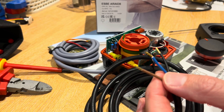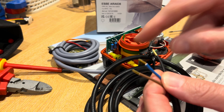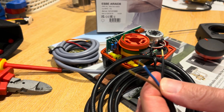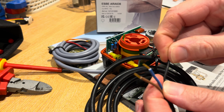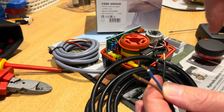You don't wire these two the other way around on the two-point actuators. With the two-point actuators, they always motor back — they're always permanently powered, and at the factory they will always power clockwise on their own. And when you switch live them, they power anti-clockwise or counter-clockwise.